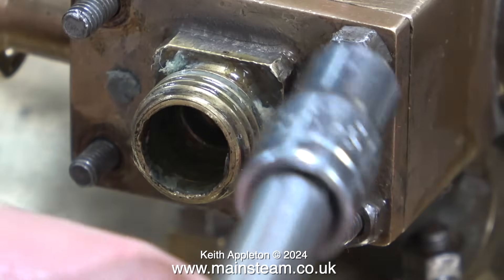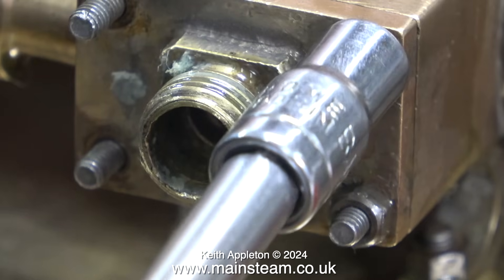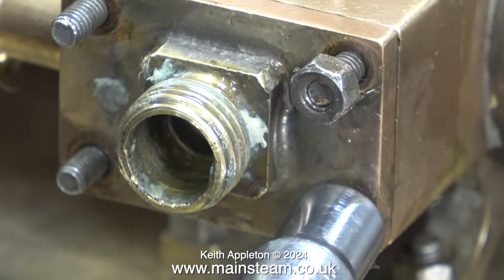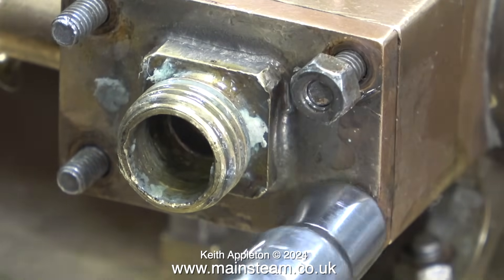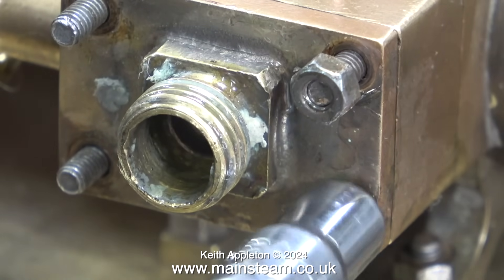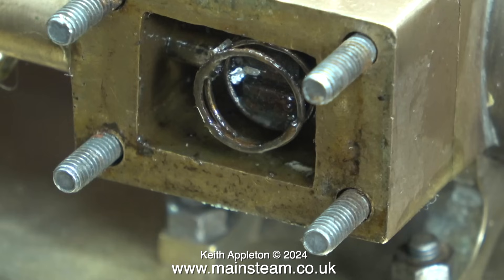Externally it may look a bit rough, but I'm going to work on the mechanical aspect from the inside. I'll start by removing the steam chest and having a look inside — my small red plastic box is at the ready to accept all the parts. When I look inside I get quite a shock: there's a large spring and someone's attempted to soft solder it to the valve spindle and the slide valve. Not a good start.